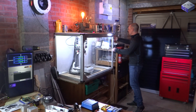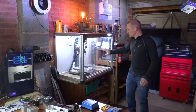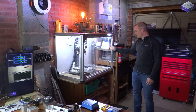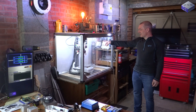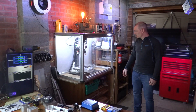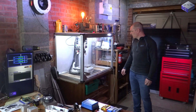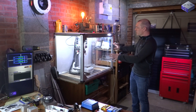This milling machine is now a solar-powered CNC mill. I've converted it with the X and Y axes — the Y-axis being one, the X-axis being the other. I'll also be converting the spindle motor and the Z-axis so it will move up and down on its own, control the motor independently, and should be able to do machine tapping — rotating the spindle down and back up again. It's also very good at clearing chips with the blower motor.